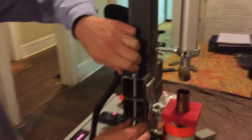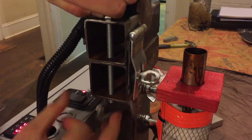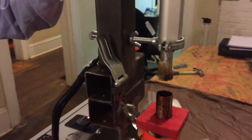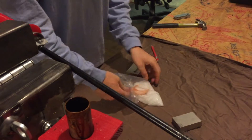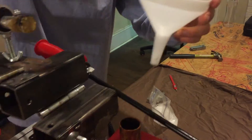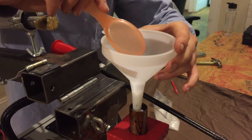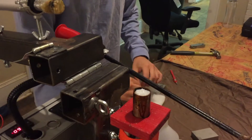The first step in doing that is unlocking the system and folding it out of the way. The next step is loading material. To do this, you'll use a measuring device to weigh out a specified amount. In our case, we're going to load the barrel with an eighth of a cup. This is polypropylene. The system can be used with polyethylene as well, as well as various other thermoplastics.